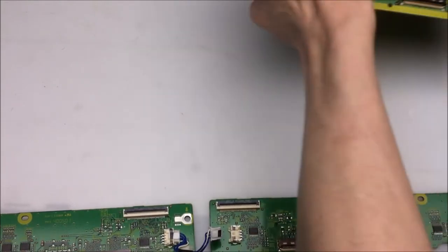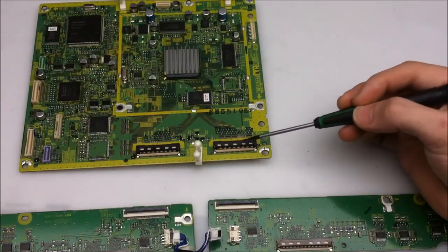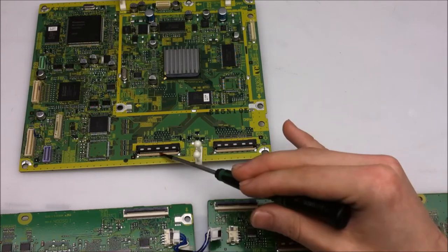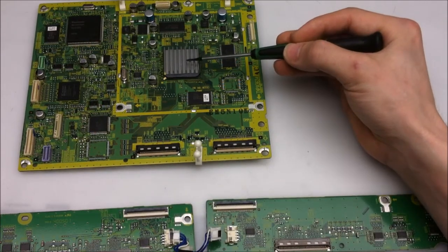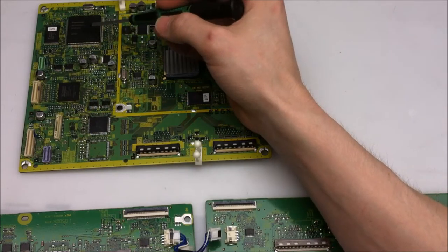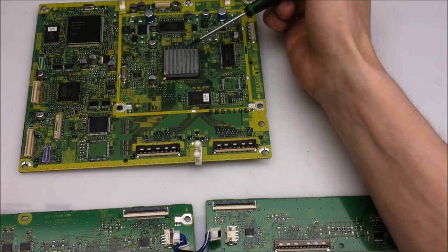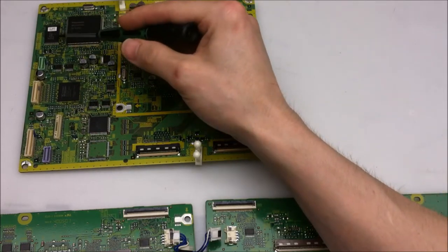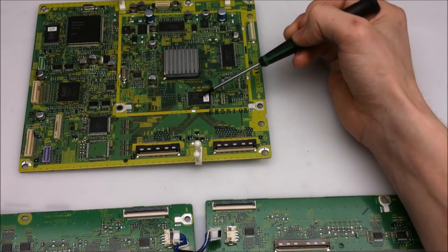Both of those are connected to the primary image processing board through ribbon cables that go here to here, and from here to here, and they get their signal from this IC right here. The horizontal control information is generated by this processor, and each one of these processors has its associated memory with it. So memory chip here, memory chip here, memory chip here, and memory chip here.